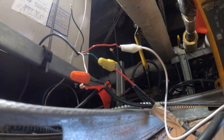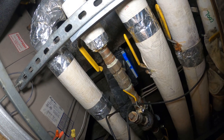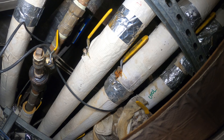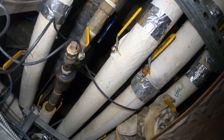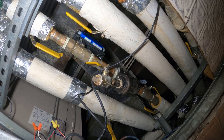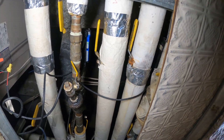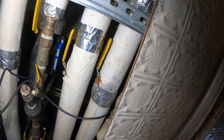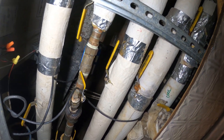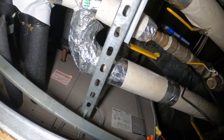I'm going to double-check temperatures again. There's 24 volts in my hand right now — this valve closed, this one opened, and our temps dropped. Even though the chiller is not on it's still not going to be pushing 100-plus degree water, so temps came down — everything's cool. I just want to call the engineer so he can operate this from his computer. During my last visit, when calling for heating the cooling valve was opening, and when calling for cooling the heating was getting power — it was crossed up — so I'll double-check that. If anyone found this video interesting or helpful, please drop a like, comment, and subscribe as I come out with new videos every week. I'll catch you all next time.